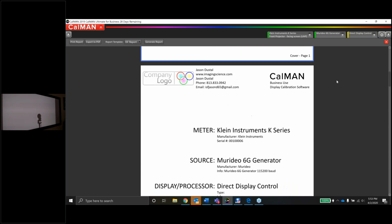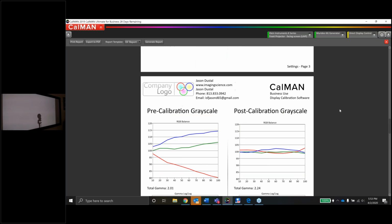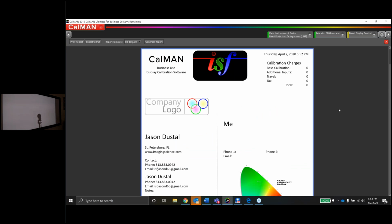This is a good SDR calibration. If this was a real world environment, I might sit here and work on it some more. Maybe do a specific dedicated dark mode. I kind of did more of a bright mode for this session because, again, it's daytime out. I've got some ambient light in the room. I do have blackout curtains, but they're not perfect. The walls are white, so I went with a 2.2. If this was the real world, again, I'd probably sit here and spend a little more time and do a night mode as well.